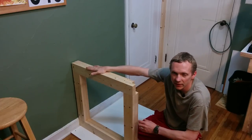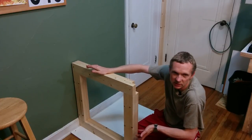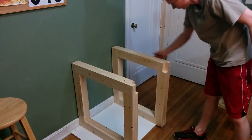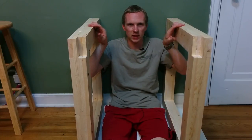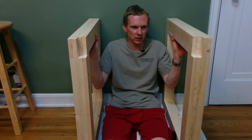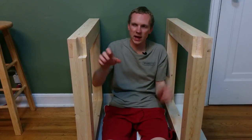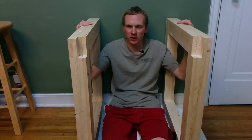Now that I cleaned up the outside surfaces and the inside surfaces, and I also gave it a sanding, this piece of the frame is pretty much done. And while you guys weren't looking, I made the second half of the frame. The cast iron top on the table saw is going to hang from this top rail with the body of the saw in the center. To complete the rest of the frame and box this in, I'm going to add sheets of plywood to the front on the inside and on the back on the inside, and I'm also going to add a support structure up front — a couple more 1x4s to help tie in this frame and make it very rigid.